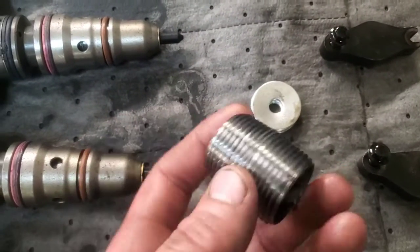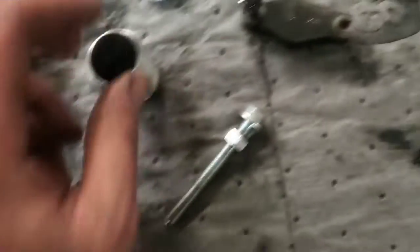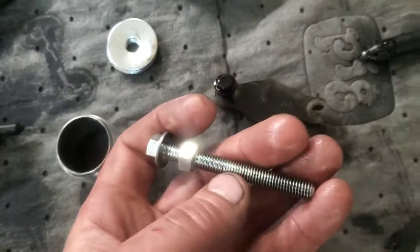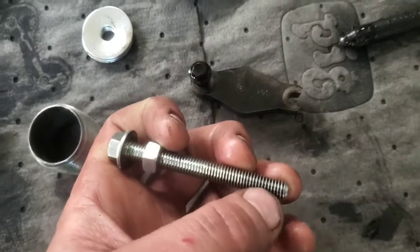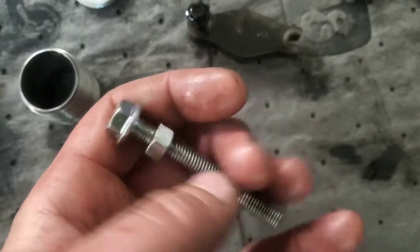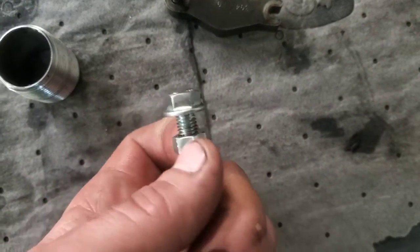This is what you'll need to get: a one-inch by close - that's what they call it - piece of pipe. We've got an 8-millimeter bolt with threads all the way up; you can use a piece of all-thread if you want, but it's got to be 8-millimeter metric threads, 1.25 thread pitch. That's the size of the bolt thread, not the size of the head - I think the head's like 12 millimeters on this particular bolt.